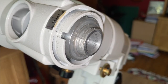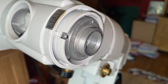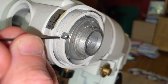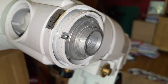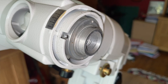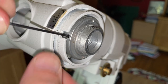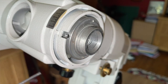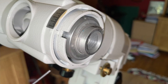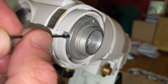Similar operation to the right ascension now — you've just got to rotate the declination axis and line it up with those holes so that you can find the allen bolts. Again I think it was a 2 millimetre allen key just to loosen those bolts, and then you can actually remove that ring as well. This is where you can see I was having trouble because one of those bolts just wouldn't come out. It's really quite tricky because it's really difficult to see whether the allen key is the right fitting, whether it's going all the way in. When it's an old mount, you just have no clue really whether it's the right size and whether it's stripped off. Once you've done this once, you kind of know and remember the state of these things.